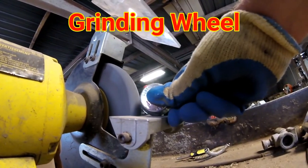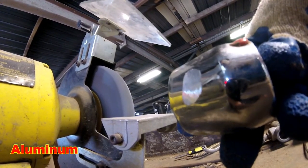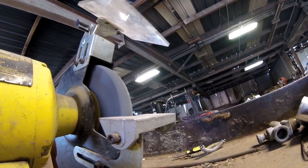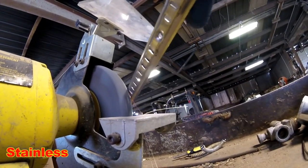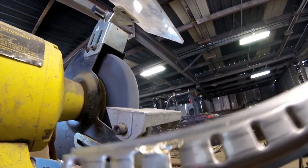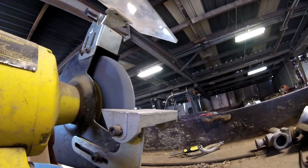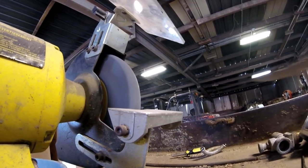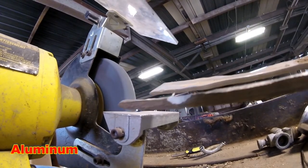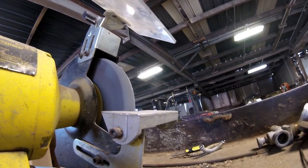I have a grinding wheel, and this is one of my favorites. The piece right now I'm scratching is aluminum — it's not going to make any sparks. If you have a large plate and you're wondering what it is, you can just use a grinding wheel off of a battery-operated grinder. So that was a piece of stainless and you can see all the sparks that were flying off of it. I'm going to do a couple more that I'll slow down so you can really see it. That's a piece of aluminum — you can see how it dug in there and made a huge indention on the grinding wheel.